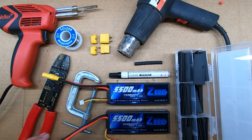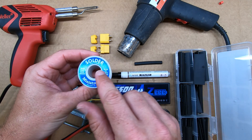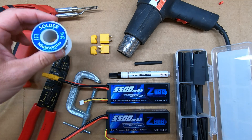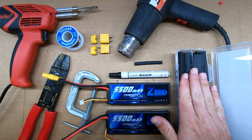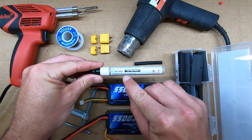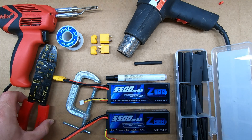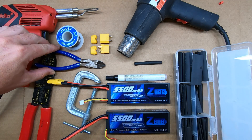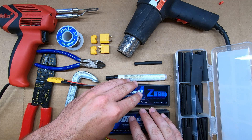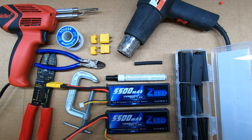Here's the stuff that you're going to need to do the soldering. You're going to need a soldering gun. You'll be using Miniatronics model number 10-640-04 rosin core high-grade solder. I'm also going to be using some shrink tubing and some flux — Kester 186 flux pen. You'll also need something to cut and strip your wires, a clamp or something to hold your bits and pieces in place, and then your batteries and some sort of heat gun or big lighter to shrink the shrink wrap onto the wires when you're done.